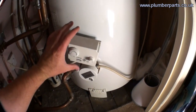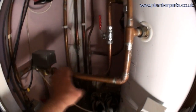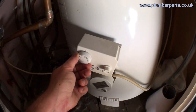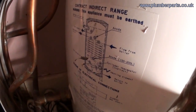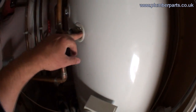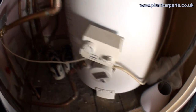Let's have a quick look. So here we go — this is the unvented hot water cylinder that we're talking about. The control for the hot water coil is here; this is the flow from the boiler. That is controlled by this two port valve here that opens and closes according to whether the stat on the side of the cylinder is calling for heat and whether the programmer is calling for hot water to be on. If you have a look around here, there's a small diagram that relates to all the inlets and outlets on this particular tank. The hot water comes in from here from the boiler, goes in through a coil round and round again, and then back out cold, transferring its heat into the main body of hot water ready to go to your taps.